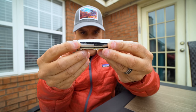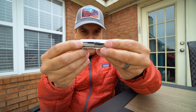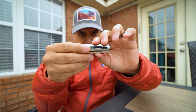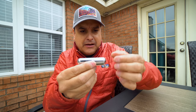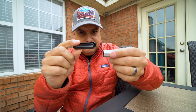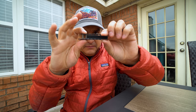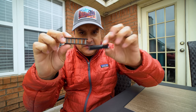And then you would have this lipstick pickup that is a little bit smaller bobbin. I typically use 43-gauge wire on these when I wind them. And then you can put whatever magnet you want — Alnico 3, Alnico 4, Alnico 5. You can make it pretty much however you want and wind it however you want. This is the standardized length of a Stratocaster screw pattern so that you could actually put this into the same pickup hole as a Strat. That's what that lipstick tube pickup is these days. It is not a Telecaster neck pickup — it wouldn't even sound the same.